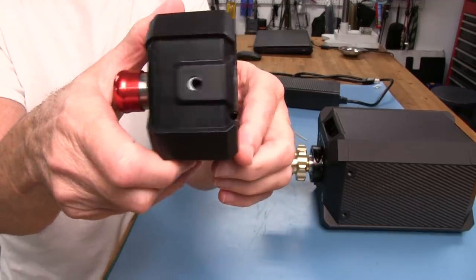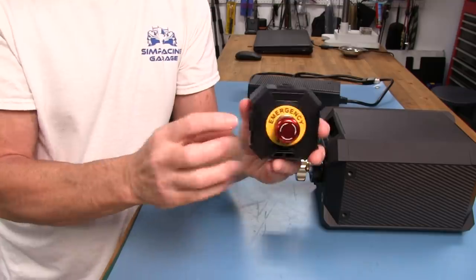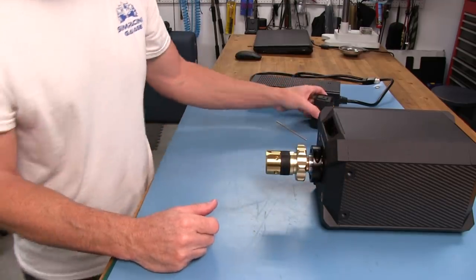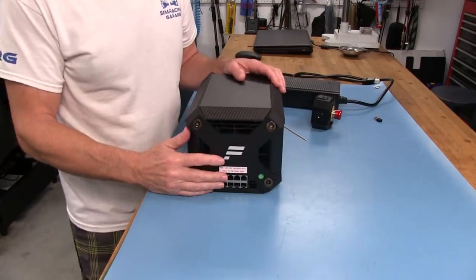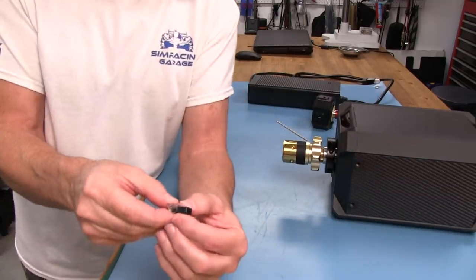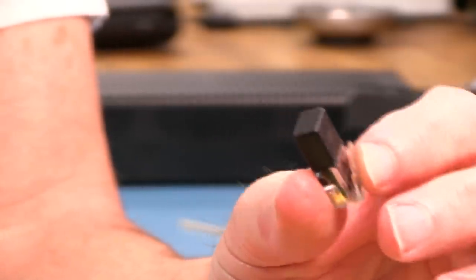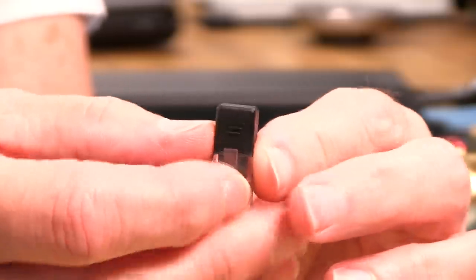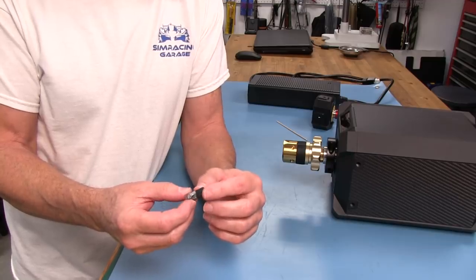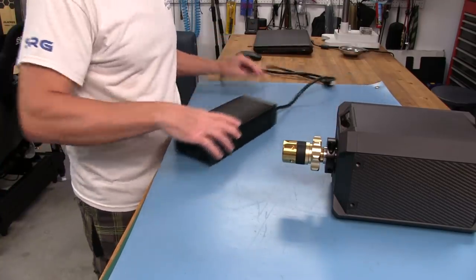We've got some six-mil fixings on there, with inserts on the metal pieces inside on three sides. So you should be able to find a way to mount it, and I was able to mount this on my rig no problem. The important piece here is our torque key — it has a chip in there in the plastic piece that tells the motor that you have the key in there, and it will enable full torque capabilities of the motor. Make sure you plug that in, because I've read on the forums where guys weren't getting full torque and had no idea why — and they didn't put the torque key in. Easy enough mistake to make if you haven't read the directions.